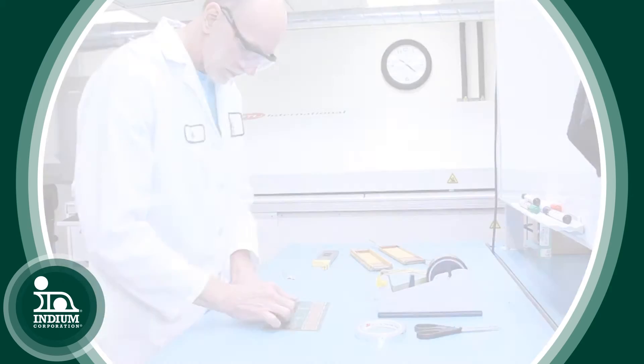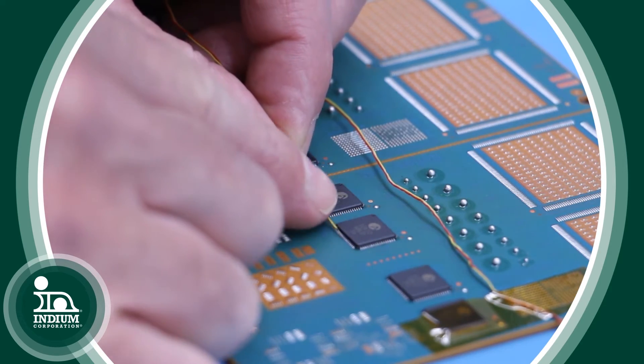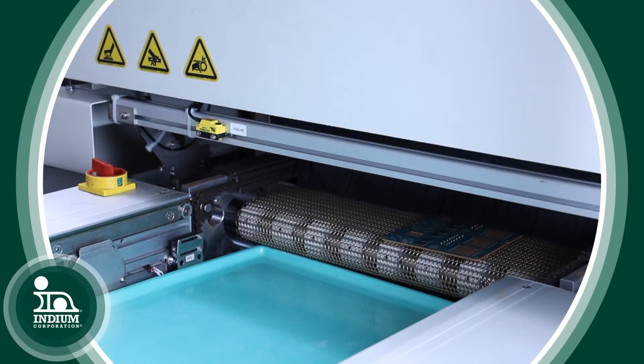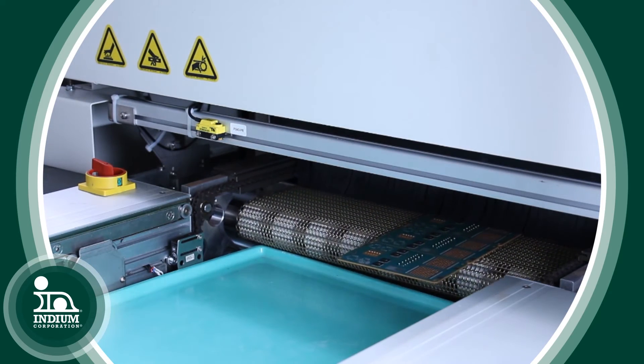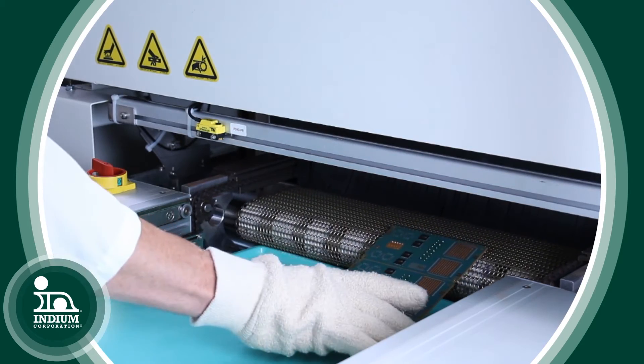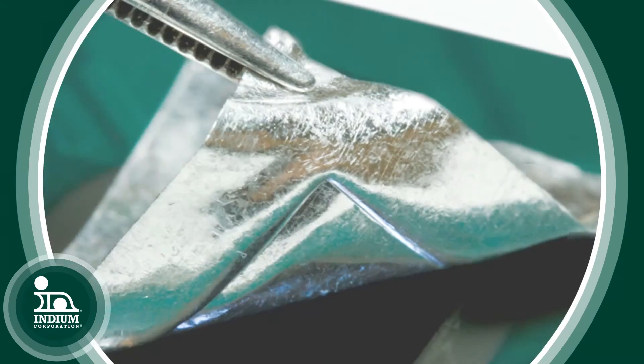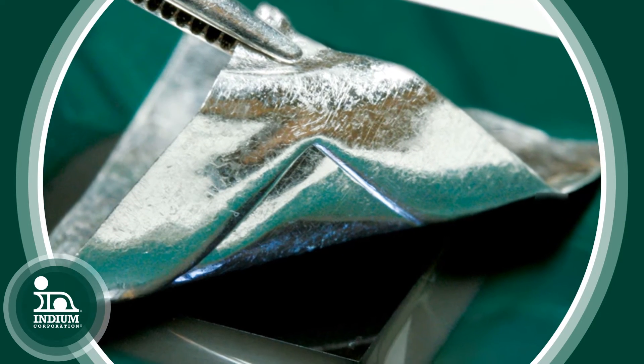What are some of the actual applications that you've seen indium alloys apply to? It's very good in step soldering — if you have a component that's sensitive to the higher temperatures of the SAC alloy, you can put it through a second reflow with a lower temperature and it won't disturb the components that you've already put down. It can also be used in sealing applications where you need a hermetic seal. If you have two surfaces that are not 100% smooth and there are some areas that might have deformation, the indium will fill in there and flow nicely, whether you're reflowing it or just using it as a compression seal. And it's also very good in thermal interface areas — it's used a lot in thermal management to reduce heat from a particularly high heat component.